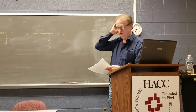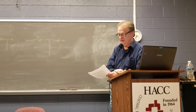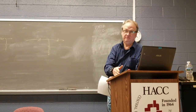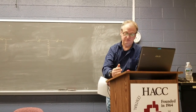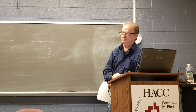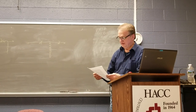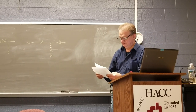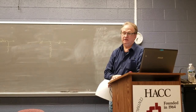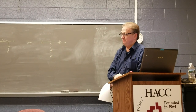Now, what does a tuner do? The only thing that it really is good for is to show a match at the transmitter and trick that transmitter into thinking that it's working into a perfect antenna. It's not. So that's the whole thing about it. Now, the other thing is, when you have an antenna matching unit like that, a transmatch, a tuner, or whatever, make sure it's grounded.